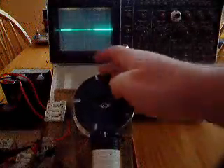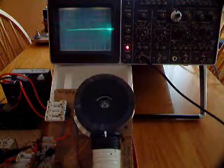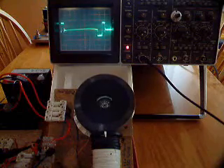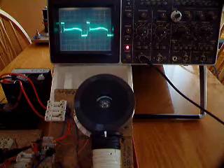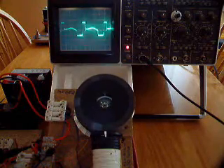Now we'll go on to the second part of the experiment with the coil of a 12 volt relay in the trigger circuit. Already you can see we've started up on double pulsing rather than triple, and that's soon going to a single pulse. Although the rotor isn't accelerating as hard, as it does accelerate you can clearly see the on time is now moving further away from TDC. These magnets are only 13 millimeters wide, so the on point is actually on the trailing edge of the magnet.